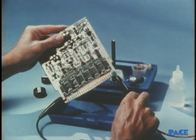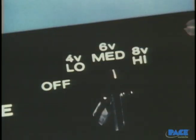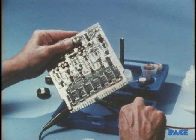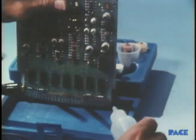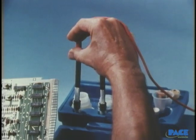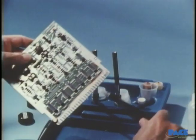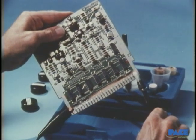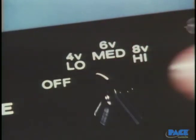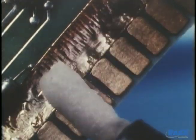Again, completely wet the entire area with solution prior to applying current. Then completely rinse the area with water. And now comes the gold — completely wetting first before the current is applied. It provides corrosion resistance and natural lubricating qualities.